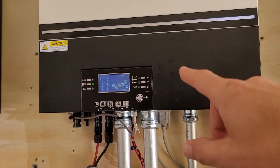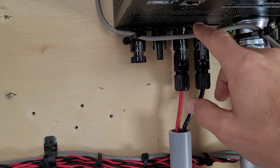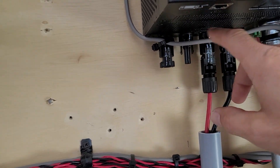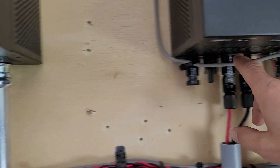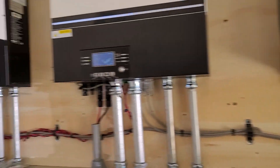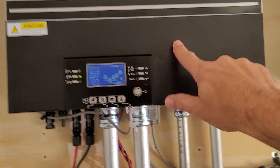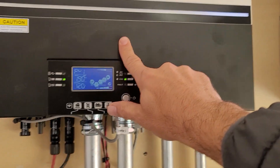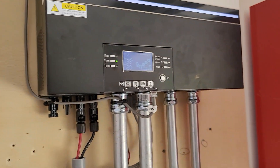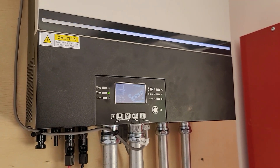String 1 travels all the way down into inverter 1, then inverter 2, inverter 3, and inverter 4. This is the PV1 connection and the PV2 connection. String 1 is 3,840 watts, string 2 is 3,600 watts, string 3 is 3,600 watts, and string 4 is 3,750 watts.